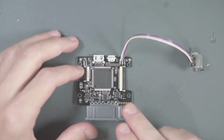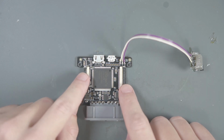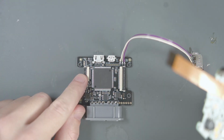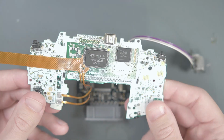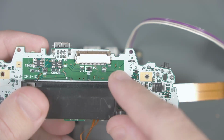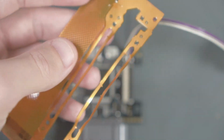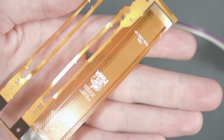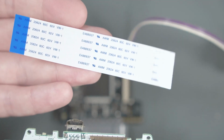With the switch hooked up to the Consolizer, we can start to assemble the Consolizer into the case. We're going to need to attach these two ribbon cables. The smaller one here is actually the flex cable that we soldered onto the Game Boy Advance CPU, but the other one is dependent on which LCD flex cable this GBA had. If you look at my GBA, mine says 32 right there, so that means that we're gonna need the flex cable that's still left on our flex cable kit here. If yours says 40 there, then you're gonna use the white one that's included with the kit instead.